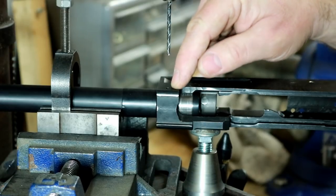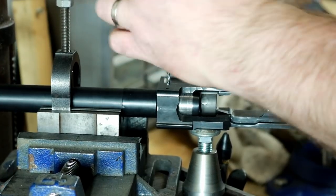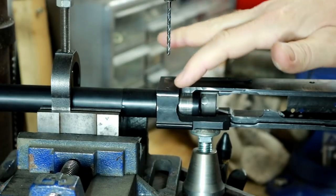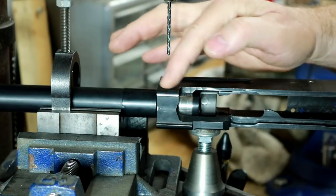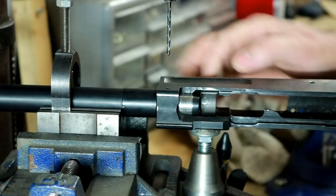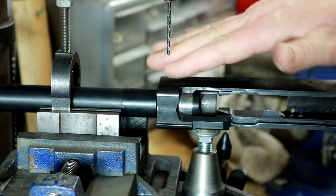All right, the little dimple in here, the hole is an eighth inch, so you just put your eighth inch drill bit in there and pick that hole up. I used a level to make sure this was level. Since it's a virgin hole, it ought to be perfectly straight through. If not, we don't have to worry about any kind of mismatch right now. It'll make a perfect hole. It'll be up to you making sure you got it straight or not.